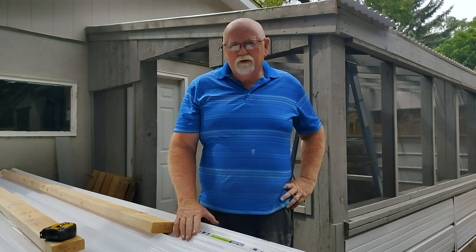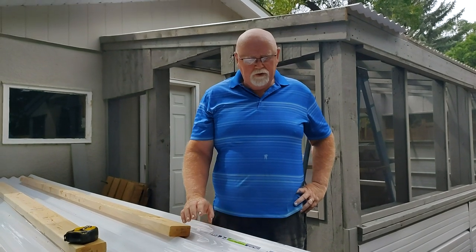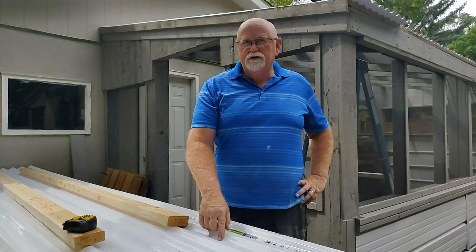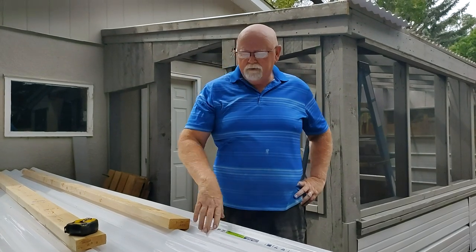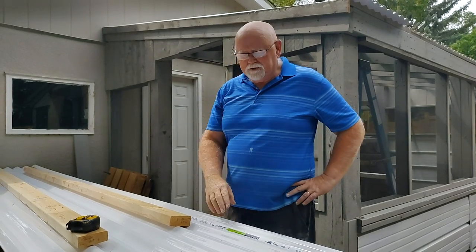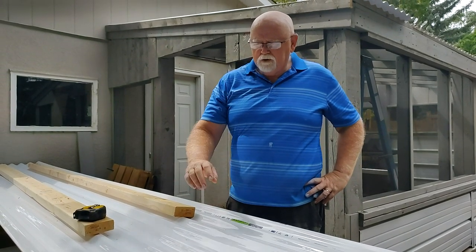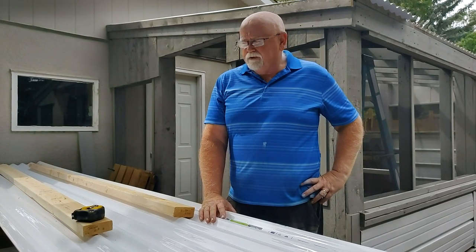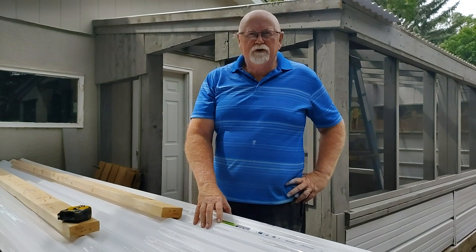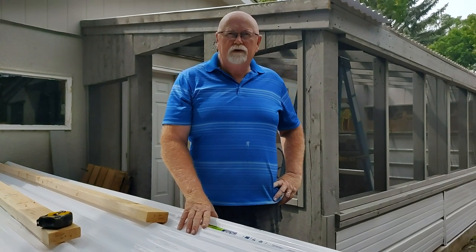We're at it again. We were going to go with the metal roof, then thought maybe fiberglass, and we went with the PVC panels. I went ahead and drilled all the sheets - I haven't cut them to length yet, just cut one to put up to see how it looks. I went along and measured where each of my purlins was so I was centered. They quoted me one screw on each side but I went back and got more screws so I have four screws to hold each panel - with the wind in this country, you never know, more is better.